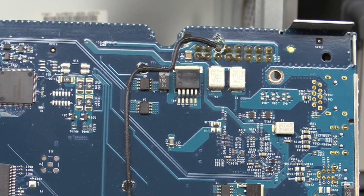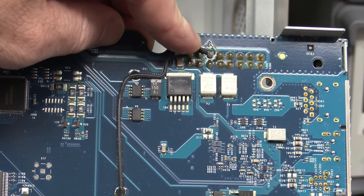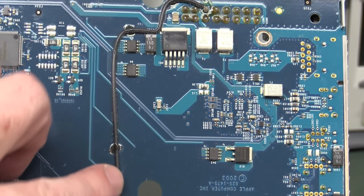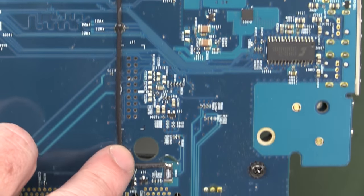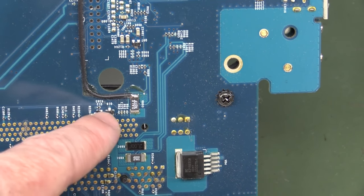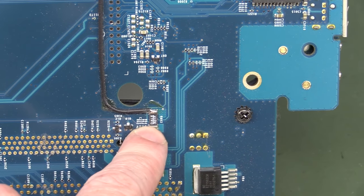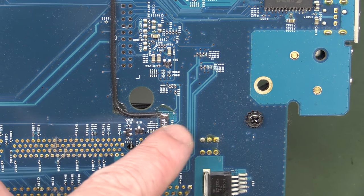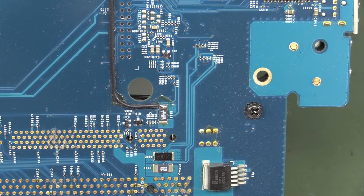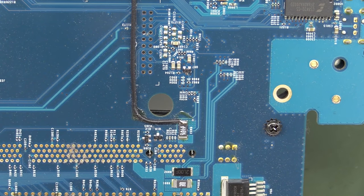But that's not as big a goof as the one they've got up here. This is the power connector with the crusty flux residue soldering. And obviously, they've screwed up some star grounding type thing, I would presume. And they brought it back to that big power resistor there. That'd be a current shunt resistor. I think you can see the two traces going off there. That'd be going into a diff amp, measuring the current, presumably, for this expansion connector.